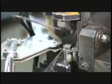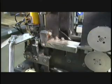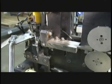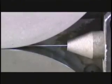Next is the core wire assembly. The core wire is made from hex-shaped high-carbon steel. Each core is cut to the required length and a ball end is applied through a pneumatic feed mechanism, which places ball ends on a pin on the core machine as they drop from the bucket. Core wire is guided through the feed tube by electrically powered feed rollers, passing the core wire behind the ball end and into the alignment jaw arms.